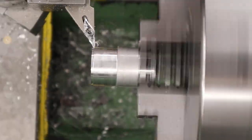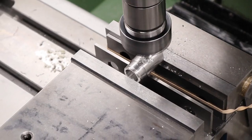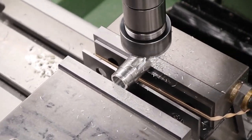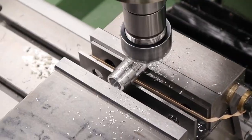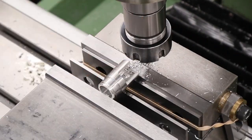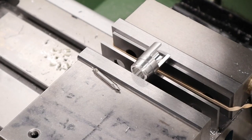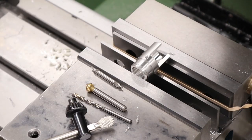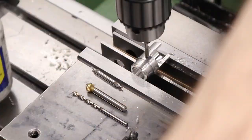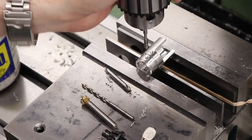This is the final setup for the part — we have to mill a slot in the side to match the magazine release fitted to the R10. We've got the part set up on some parallels and we're slowly milling the slot. This isn't an ideal setup; I would have liked to put it in a v-block but I didn't have one short enough to clamp the part, so we're using parallels on this occasion — a v-block would have been a more secure setup. The final thing to do on this part is to drill and tap the two securing grub screws that will secure the back boss to the barrel itself and also secure the carbon fibre to the back boss.